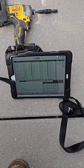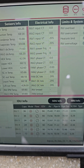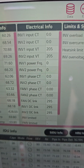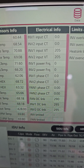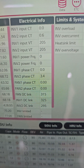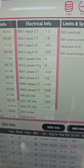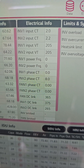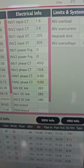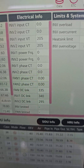Okay, I think we're coming right now. Let's start. Nothing yet on the amperage. Just watch it close. I want you guys to see the amperage spike on the tool — meanwhile I'm looking at the meter. Here it goes. See the amperage? See the spike? 43. My meter says 62. 49. It's spiking right there. Compressor number 2 is trying to start as well, but compressor 1 is drawing significantly more amps than compressor number 2.